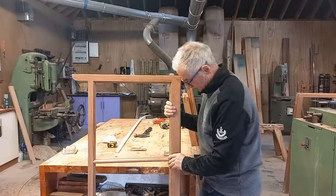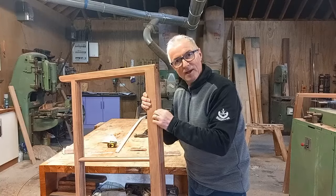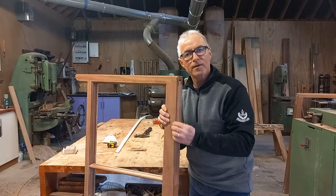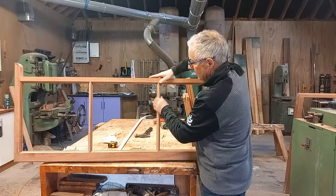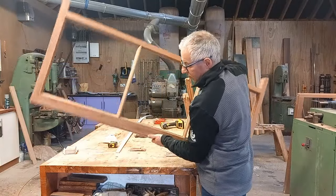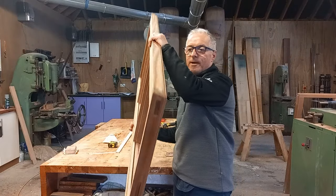So this is the front side obviously — this is the inside. The base has a slope on it here, 14 degrees in this case, and the tracking will go on there — the weather seal tracking — to seal it down onto the sill. Part of the sash here shows the inside; it's got the slope on the edge there which meets the sill part and goes down.